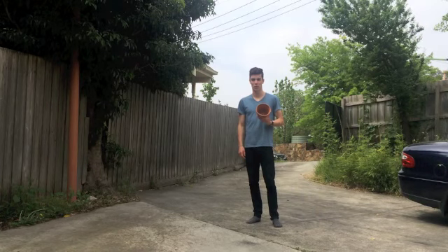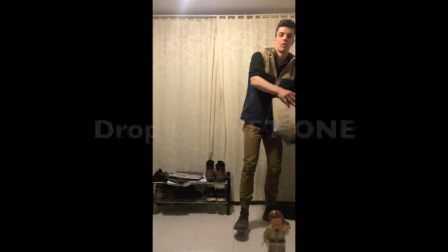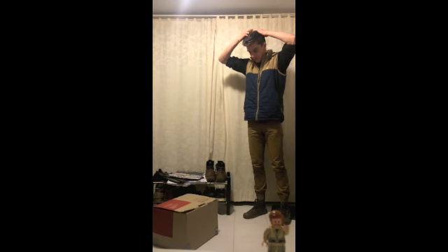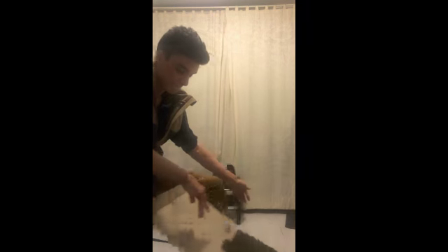Gujarat in India is famous for its pottery all over the world, but here's the problem — it breaks. Drop test number one. As you can see, it's designed to be robust enough so that when dropped, the pot inside the packaging doesn't break. So got a few issues. A little buffer is designed to absorb some of the impact, but as you can see, it has absorbed some of the impact and crushed, then transferred that load right into our pottery.